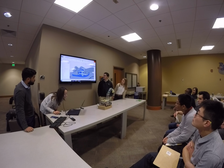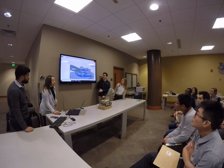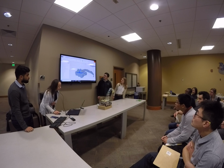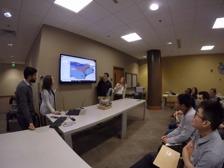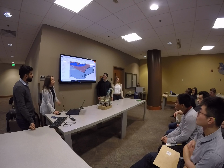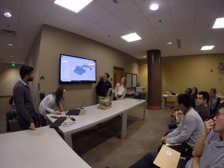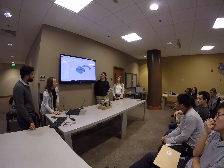Going along with that, as you can see, we have a lot of moving components here. So the base also rotates, and that will be shown in the demonstration, with our rotating base from our servo motor. And then the last part that we had rotating was the motors here, and it's kind of hard because there's no track on this one, just because it's hard to model in Creo, but the motors would rotate here as well. And so as you can see, with the whole assembly, the arm would rotate with the syringes, allowing the syringes to open and shut as the arm goes up and down.